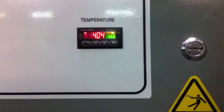Remember, when the machine is new you need to do this about once a week, because the temperature signal is going through a commutator. The rings on the commutator and the brushes are going to wear in a bit, so the signal is going to change over the first month or couple of months. After that, you can go to checking the temperature once a month, but it's up to you. Some people do it once a week, some never — it's better to do it more than never, and it's always good to check that it's not fluctuating.